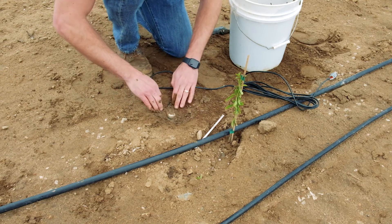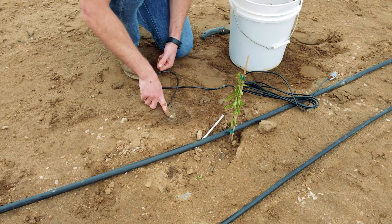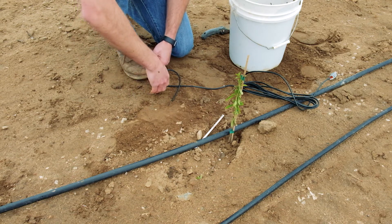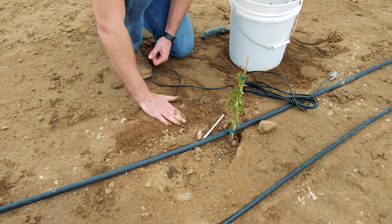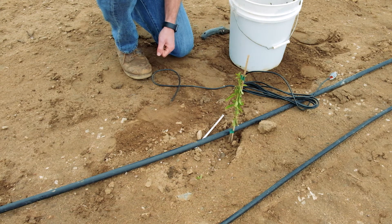You can pull away the extra slurry — you'll notice most of it didn't come out, which is fine. Then just to keep it from cracking, you might want to put some dirt over the top. If you get a crack in that slurry, water can drain in there and you might get an erroneous reading. So we've got the probe in the ground — we'd run our wire to our device and we'll instantly start getting readings.